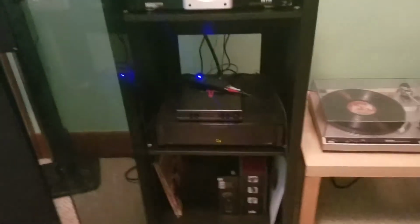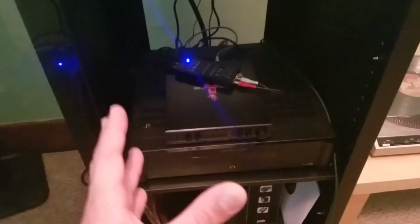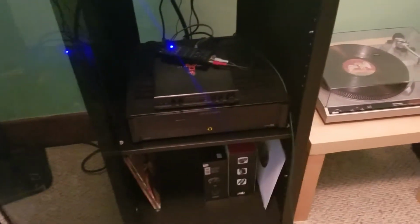By putting those things together, it makes it kind of difficult to achieve the best possible sound quality in the world. It just does. There's no way to fit all the componentry into one thing and to separate them inside the chassis so eloquently that you're actually eliminating 100% complete interference. There's always a possibility of interference unless you're doing a Faraday closed cage design like this, which can't be done with any amplifier inside of it. You need vents so those heat sinks can breathe. So that is what an integrated amplifier has, well, normally just the preamplifier and amplifier in it.